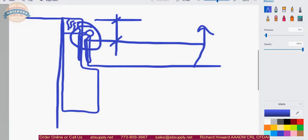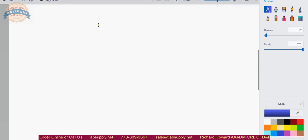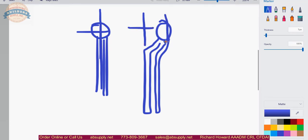The client also provided some additional photos. Here is one — same kind of look, a raised barrel hinge. A standard hinge has its leaves like this; a raised barrel hinge has this large bend to it. The whole point is that the vertical axis of pivoting would normally be here on a frame, but now it's been shifted over. That vertical axis of pivoting has been moved over to get it off the jam.